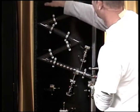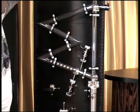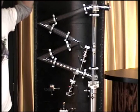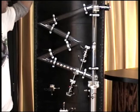what this block center I alluded to will do for you is we can actually jog. If you get back over to Shane, he's going to jog that 2-inch cylinder up. And if he lets go of it, it's going to stop and hold. So you can actually position that cylinder by that valve, up and down.